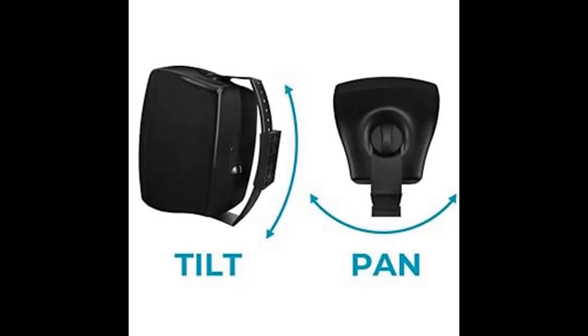Of course, the built-in 8-ohm tap still lets you connect these speakers to traditional 4 or 8-ohm home audio amplifiers, so there's no need to buy a 70-volt amp if you already have a home audio system with enough channels and power to add an additional set of speakers.